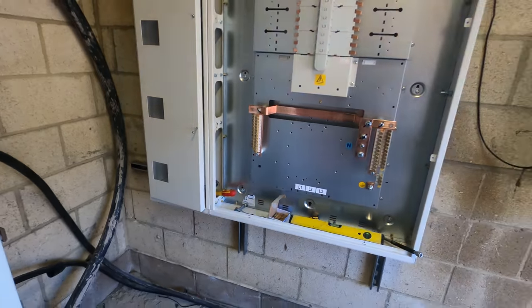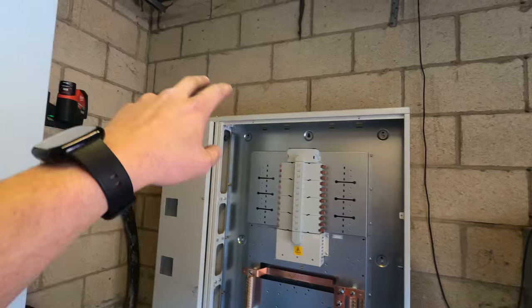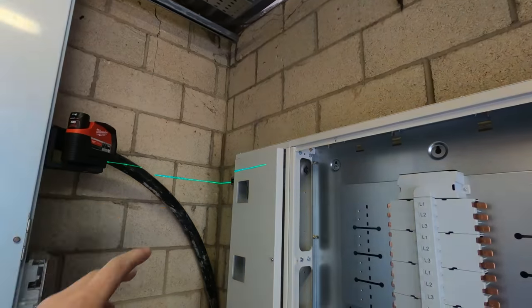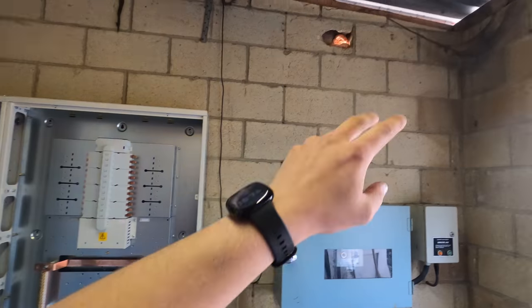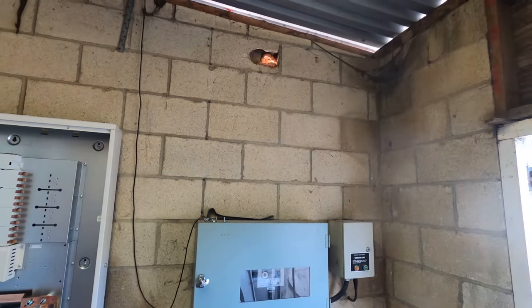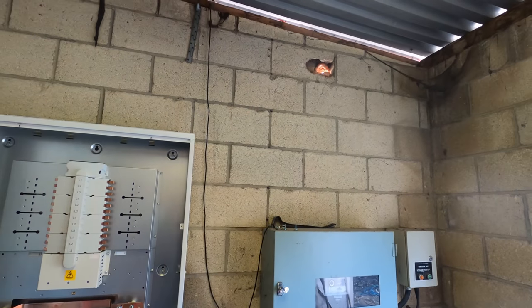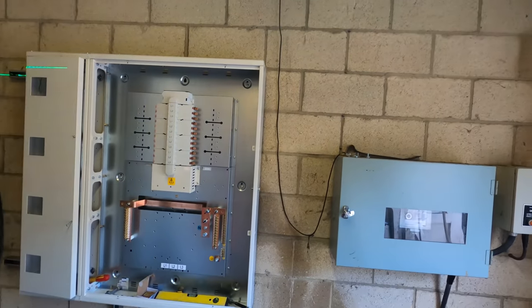So yeah, we'll need a couple more feet for the trunking there, one up top, one there, a couple of spans off there, and then we can look at getting the trunking cut in all the different pieces, getting that mounted. I've also got a bit of tray to run through here. For some reason I've got 6 inch, but I think I'm going to go for 9 or something, a bit more future proof. So I'll grab that today, but we can get all the feet on and stuff and ready for the tray to just bolt to it.